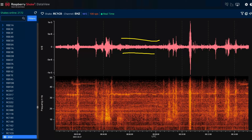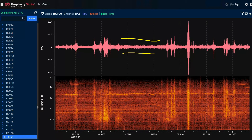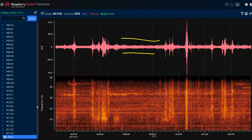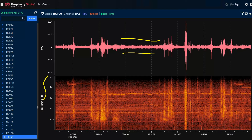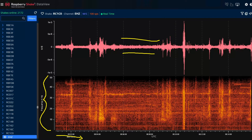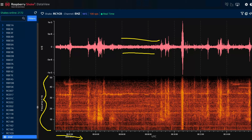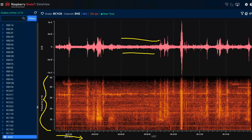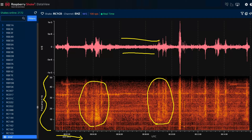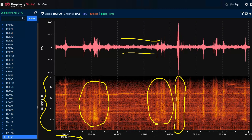This top graph is the data trace from the Raspberry Shake's geophone sensor. Embedded in this trace there are a lot of different frequencies, and you can map them out in something called a spectrogram to get a visual two-dimensional representation. The y-axis is frequency from 0 to 50 hertz and the x-axis is time. It's quiet right now because it's about 2 in the morning, but there's a four-lane road about 200 yards from my house — those are vehicles driving by. These are actually my footsteps from inside my house, and the Raspberry Shake is located 20 yards away outside. It's so sensitive it's picking up footsteps in the house.